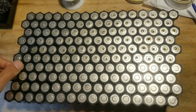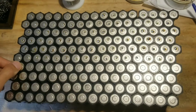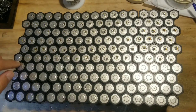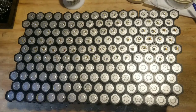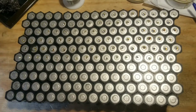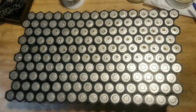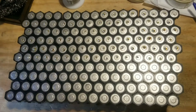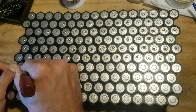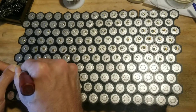On the negative side, all the heat starts going into the battery as soon as you touch it, so you have to be very deliberate and do small solder spots. You should probably use a higher power soldering iron with a thicker tip for more thermal mass. I'm using a 50 watt Radio Shack soldering iron here. It also helps to scuff up the surface — I've got a sharp flathead screwdriver that I'm using to scuff it up.